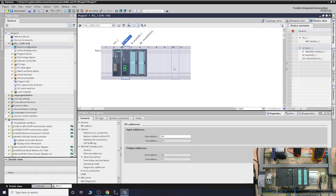The card is pretty much ready — I've already loaded this configuration, so you just click load and fire it back in. Now, what I'm going to do is unplug the blue cable and put in the white cable, which means the PLC is now connected to the network. Knowing the IP address, it should now be accessible to you.